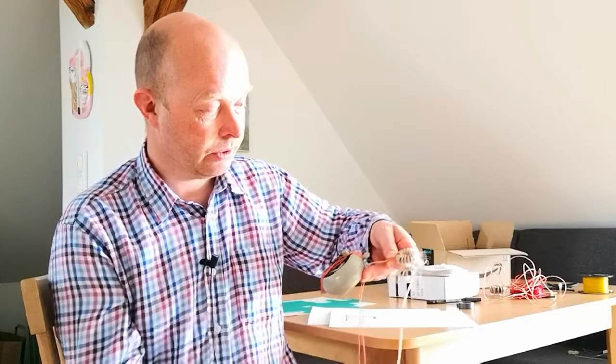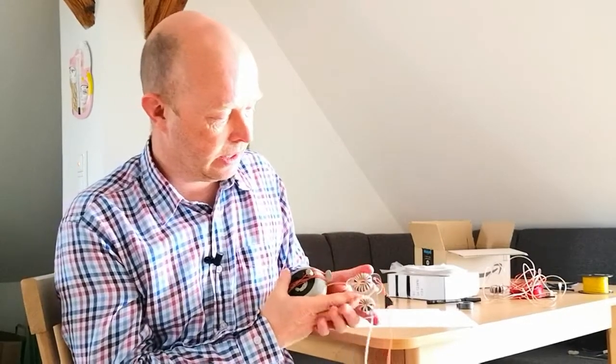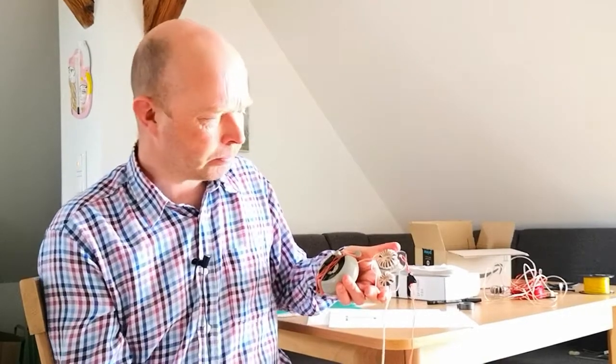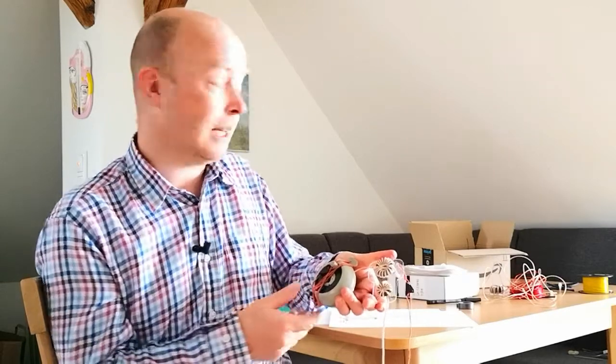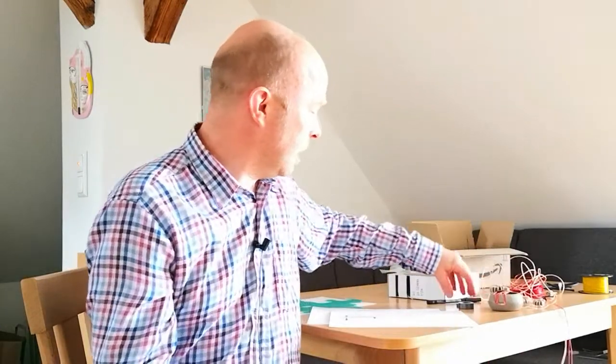Again, this antenna was cut for 40 meters, works fine on 40. It also tunes up on 60, and one thing I've found after using these antennas is that a 3/8 wave will actually radiate very, very well. So although this is electrically a bit short for 60 by about 10 meters, it actually works really, really well. The beauty of that is that if you want an antenna for 80 meters, you only need to make an antenna for 60 meters, and it will still radiate pretty well.